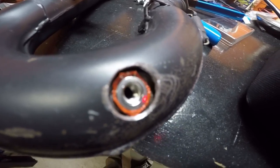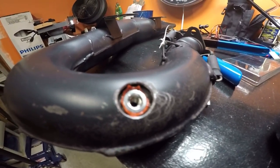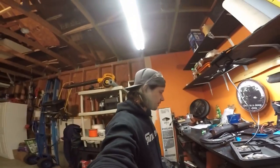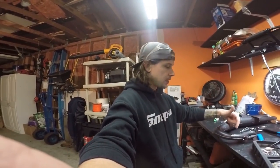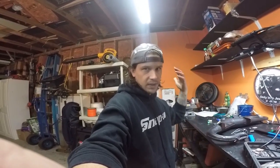Okay, so you thread the tool out, and then your rivnut's in there. You wanna make sure that that face is real smooth too. You can see the RTV kind of squished out there. I'm gonna let this cure overnight. But that's it. And like I said, if you were to not have made the mistake and drilled through the heat shield, you'd be done in way less time.